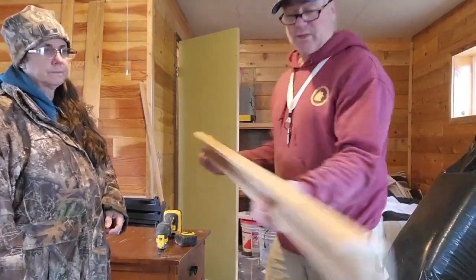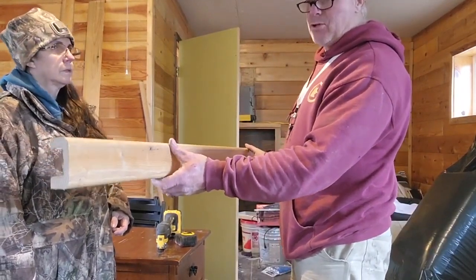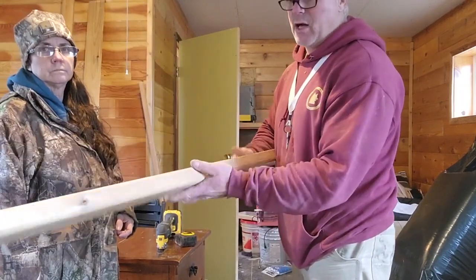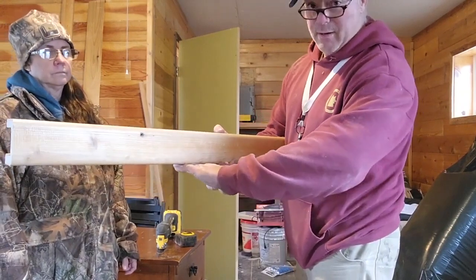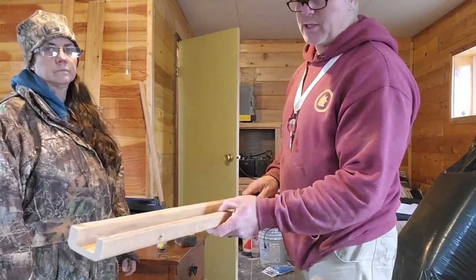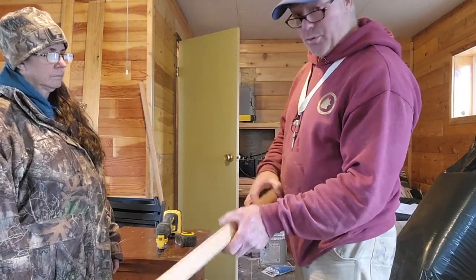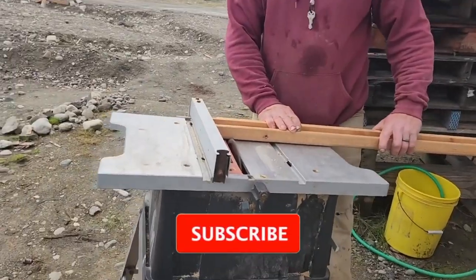Against the wall. So this looks like a mop board when it goes on top of the tile that we're going to put in there. So you don't see the PEX tubing coming across the base of the water lines. After I've dadoed this out right here, it'll hide the PEX on the inside of the wall. So the PEX will be on this side, the tile will be under it, and then this will show like a mop board here. So it's to protect it as well as to conceal it, but right now we've had to modify it a little bit, and we're getting ready to cut it to length. And rather than drill a hole through this for the stem out for the PEX, I'm just going to notch the bottom and set it down over the top of it.